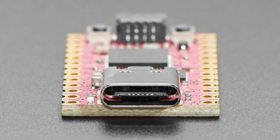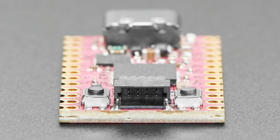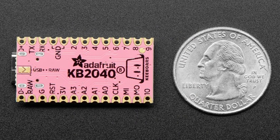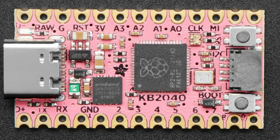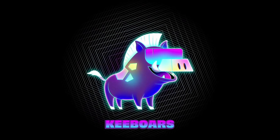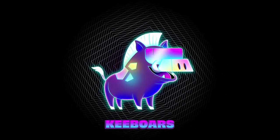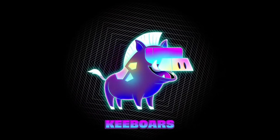In addition to all the Pro Micro pins you know and love, it's got USB-C, it's got Stemma QT so you get two extra pins, and you can do a 10-by-10 keyboard array if you'd like. It comes with headers and has castellated pads. You can short the USB if you want more power and want to skip the fuse. They also bring out the two USB data pins, which could be handy if you're doing a really funky wiring setup and want the USB port totally separate from the board. And you get to keep that graphic for free — right-click, download it, give it to friends, and funge it all you want.